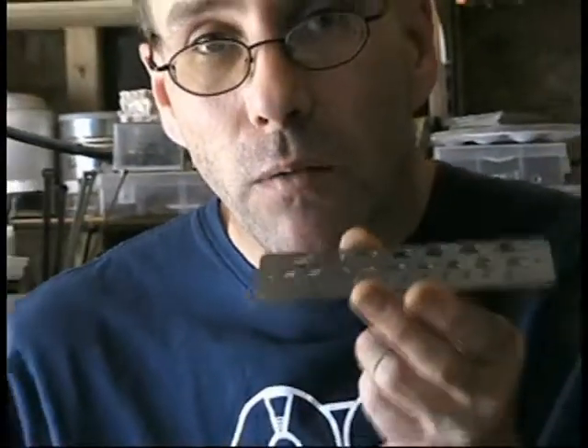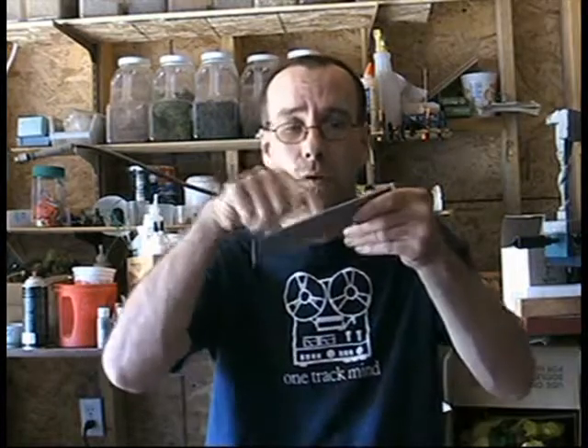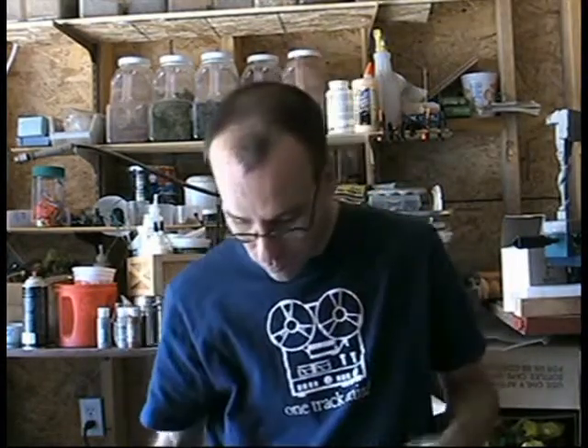You just keep going down through smaller holes. That's about the only way you can get a piece of wood down to a really small round one-sixteenth of an inch — you need something along this line. The draw plate here is actually kind of beveled; the holes are beveled a little bit. Never seen those before? They're kind of cool tools to have.